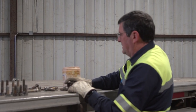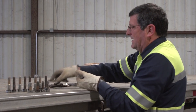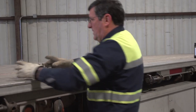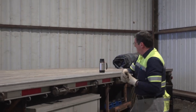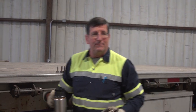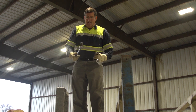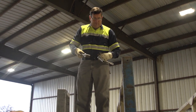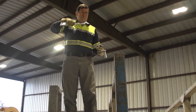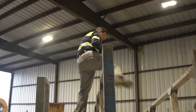There's no need to keep these out. Try to practice good housekeeping as you go along so you're not cleaning up a big mess later. I am ready to go up on top of the trailer — everything's out, everything is near where it needs to be. I've got a 15/16-inch wrench on the socket. It's better to have a deep well, and if you can get a deep well impact it's even better because they're more durable than the chrome vanadium. The deep one lets you get over the sides of the feet, whereas this one's limited to a smaller arc. I'm going to deploy all my bolts.